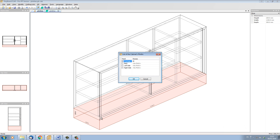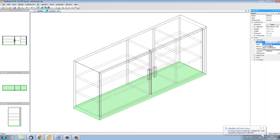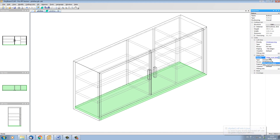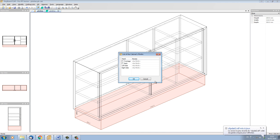What would happen if the bottom was not assembled with a mitre joint but was assembled between the two sides — that is, underpassing the two upright sides? Let's get rid of that plinth I just added, and now if I select the bottom and it's linked to the left side, instead of a mitre joint let's put it underpassing, and the right side the same. So we can see now that the sides actually pass over the bottom. If I go underneath in the plinth area and click right to open the add plinths menu, I can see that I have a tick box for the front and back but I do not have any tick box for the left and right sides — I cannot put a plinth on the left or right side if the bottom of my cabinet is not overpassing the sides.